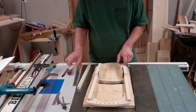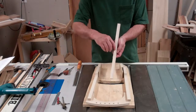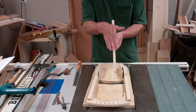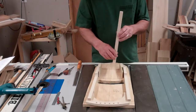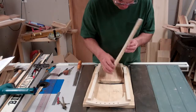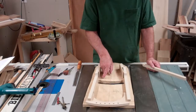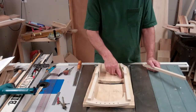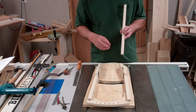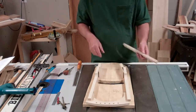Clean up all the joints. Also, in order to make this glue block from our rough piece of stock, I put a line that's four millimeters down from the top and I will bevel this way to meet that — that will give us the perfect block. When we put it in this way the bevel will match pretty close to our top side right here, and that will give us a nice smooth, good transition point and a good glue area to attach that part of the side. So I'm going to bevel this and clean up these blocks.